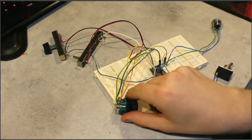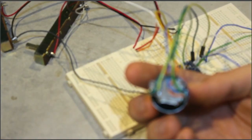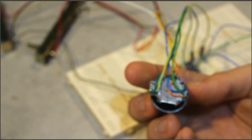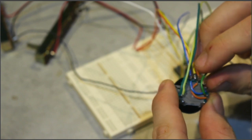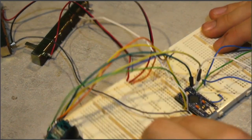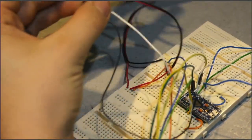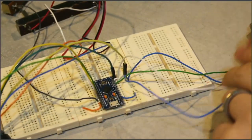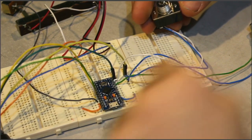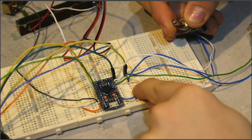Here we are with the wiring done. The joystick is connected on a common ground and a common DC line going to both outer edges of the wiper pins. The wiper pins themselves go to our analog inputs on the board, with power and ground going to the power and ground buses. The faders' contact pins go to their analog inputs on the board. The switches are connected between the ground bus and their allocated pins, so when connected they will short and trigger the pins.